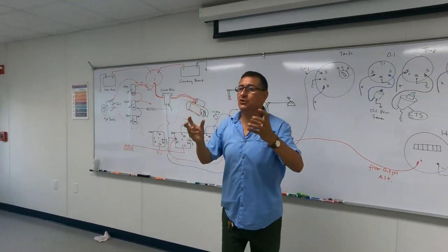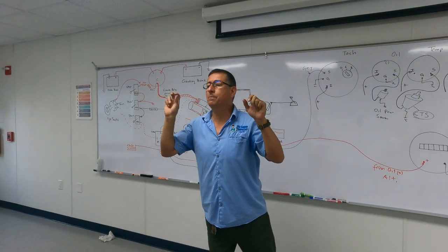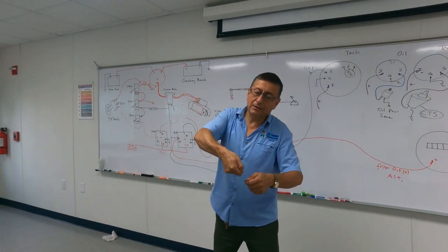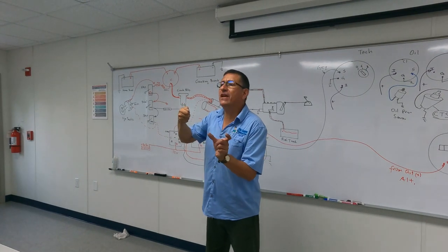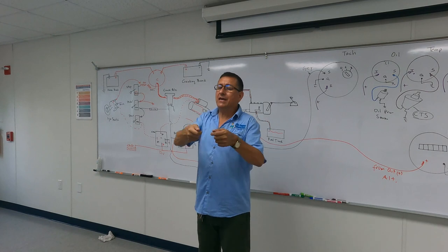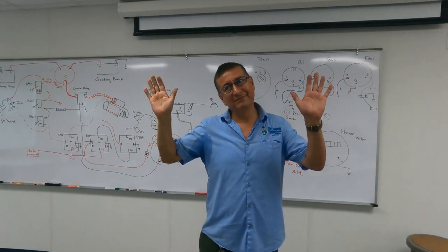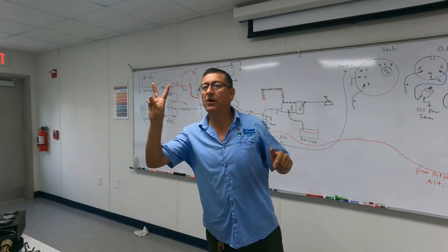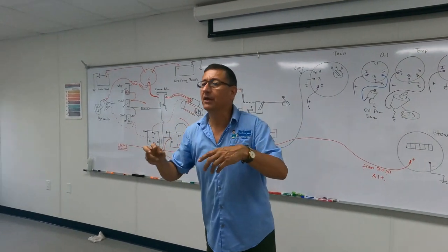Step number one in that procedure to investigate what happened in that situation, low oil pressure: check the level, color, and odor of the oil. Milky. For milky oil there are two possibilities: raw water with the oil or coolant with the oil.